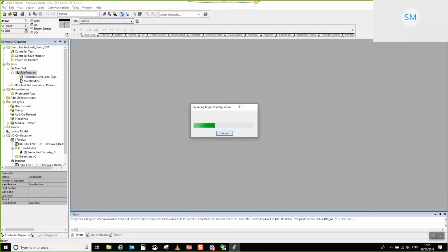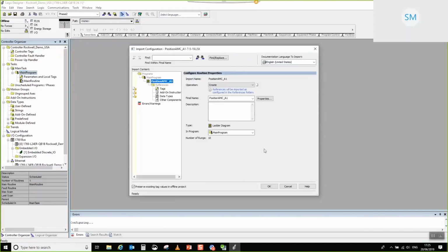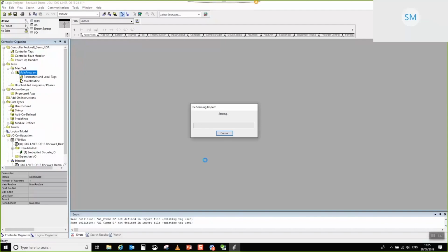It's quite helpful because the way that Rockwell have set up their system is such that any sub AOIs that go to form, like an outer AOI, all get pulled in as a result of you dragging in, for example, a parent AOI or a parent routine. So it's quite a nice feature of their system. There we go. When this screen appears, just click OK, and then that will go and add all of the AOIs that is just extracted from that compound file that we clicked before.